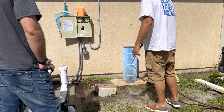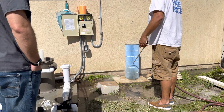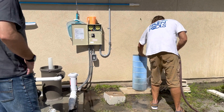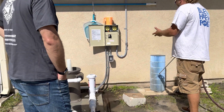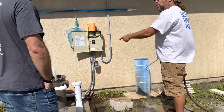And then your pressure gauge also will tell you that. It starts right now. We'll see where our pressure is, and if it gets above 50 psi, and I can't get it below 50 psi, it's time to throw it away. All right. Now I can go. Do I have to have this exact filter? No, I do not. Any cartridge 225 will work, okay?